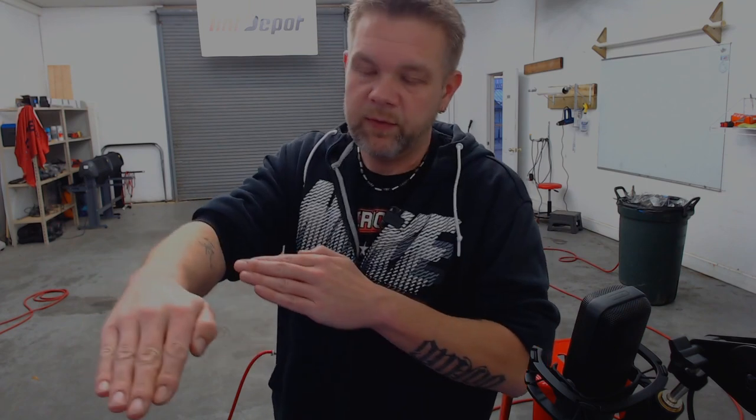The point of it is this. You don't want the machine to be shoving the film through while it's cutting. That means your blade's down and it's shoving film through. That causes a mess, and a lot of machines can't tolerate that, and it will bunch up the film. So cut on the pull, or pull mode cutting, means that when you select a pattern and it's 12 inches long, the plotter is going to drive 12 inches of film out of the front. The needle will drop and it'll drag the film back through as it cuts, and then it'll start again and then do the other side.